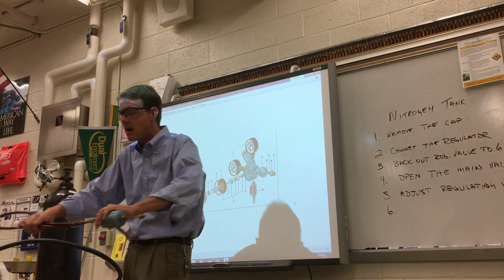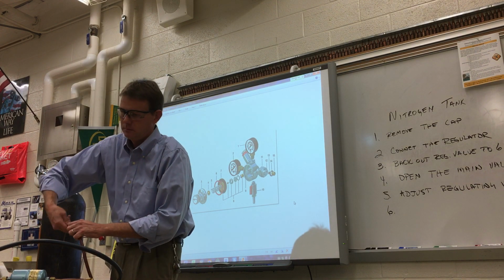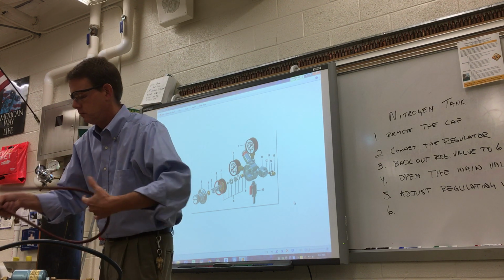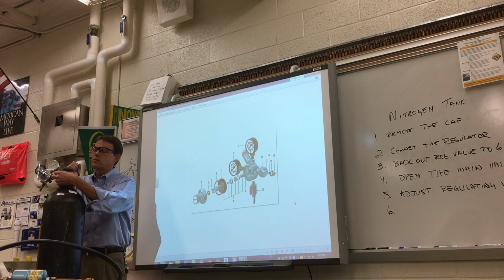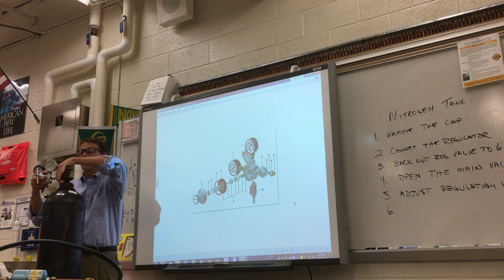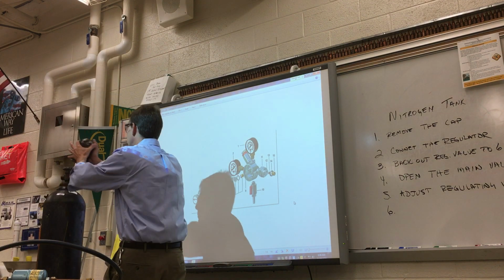So I'm going to go ahead and do it one more time without any interruptions here. I'm going to go ahead and set it up. Zero, 0. Now look, if you tightened it facing the regulator, to loosen it, same thing. Get the flare nut wrench on it. Loosen it up. That's it. And then put the cap on, and the next person's going to go.